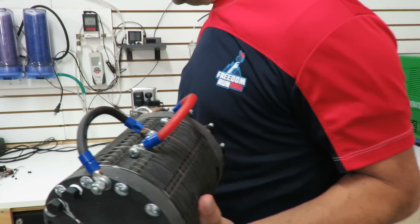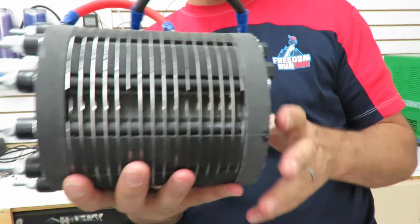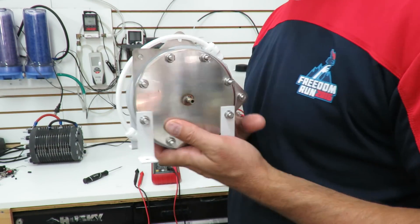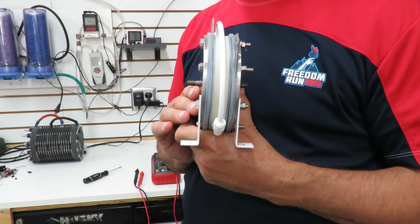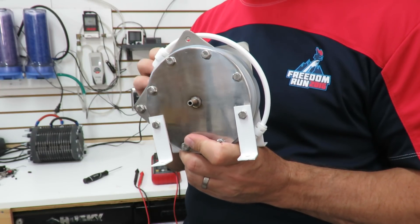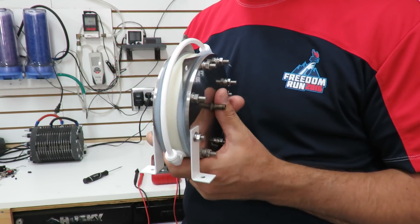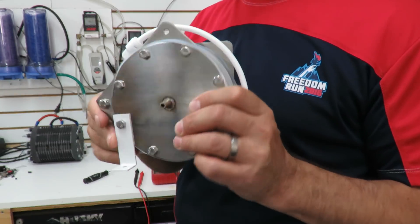This cell has four plates. The old cell has 16 plates and uses a lot of KOH to get one liter per minute. So the new cell will generate up to one liter per minute, and it does it very efficiently. This cell has an input of five volts DC, and we run it at about 20 to 30 amps. At 20 amps you're at about 0.6 liters per minute, at 30 amps you're at one liter a minute. At its maximum, most inefficient setting, it uses about 150 watts to generate one liter per minute. Very efficient, very good cell.